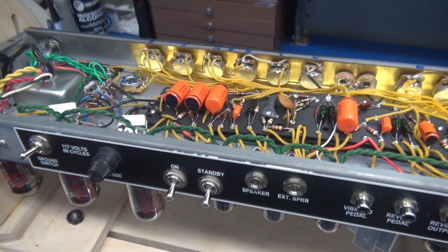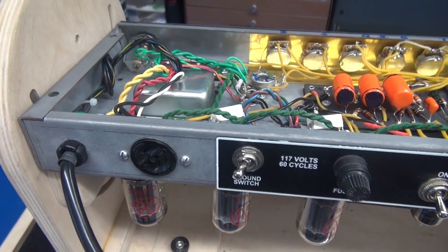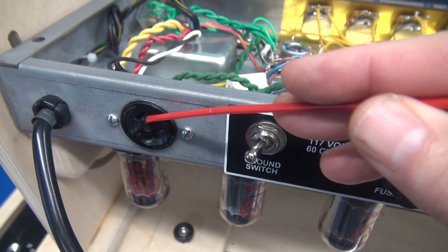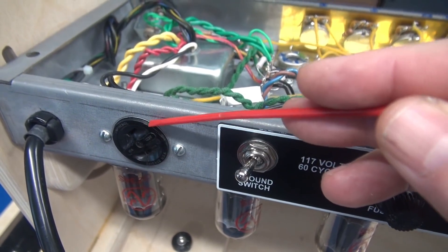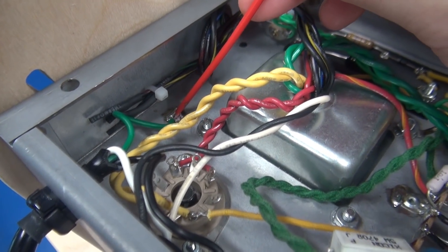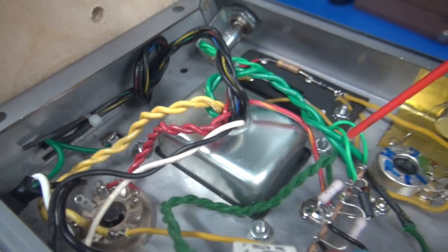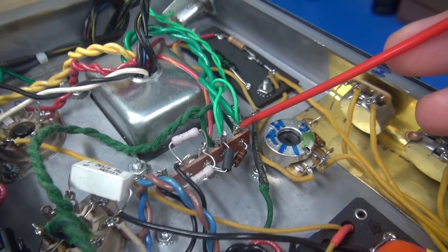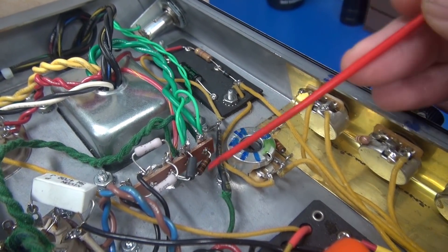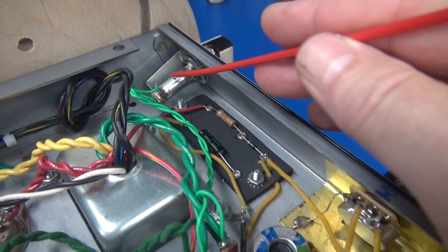Let me give you a guided tour of the things I did to correct the noise levels and bring this amp closer to a stock Fender configuration. First, an AC outlet was added to the rear — this is the stock Amphenol two-prong style used back in the day; the customer asked to have that added. The line cord comes in, and where there was previously a crimp-on ring connector going under the power transformer lug, that is now soldered direct to the chassis. I added a terminal board — the filament lines come in and land here with 100 ohm resistors for balancing, then high current takes off to the tubes, and 20 gauge wire feeds the dial lamp.